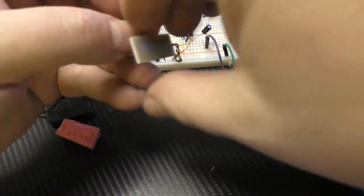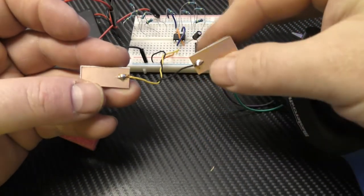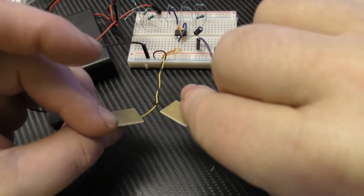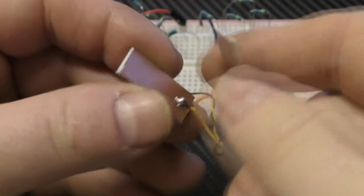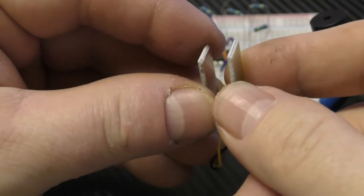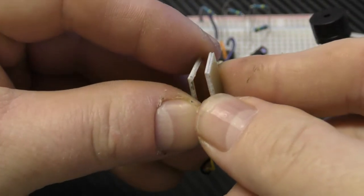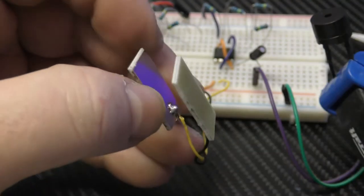You can see I've just cut up some copper clad fiberglass board used to make circuit boards. I've soldered some wires to them — voila, there's our plates! In fact, just holding them this close together, they have capacitance. It's a very small value in the picofarad range. I did the math and this one is about 15 picofarads when the plates are about 6mm apart.